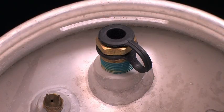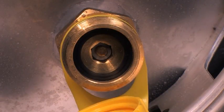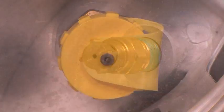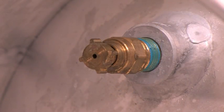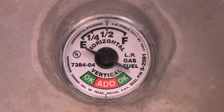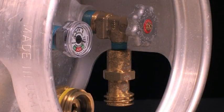A rain cap or dust cap must also be in place. Filler valves have an internal check valve to limit fuel loss in the event of an accident. This valve should be covered with a plastic cap. The fixed maximum liquid level gauge is an integral part of the filling operation when filling cylinders by the volume method. DOT cylinders may have a fuel gauge using a magnetic liquid level float dial inside of the cylinder. The liquid hose is the part of the carburation system that is equipped with the female portion of the connector. The liquid service valve is equipped with the male portion of a forklift connector, which acts as an added check valve.